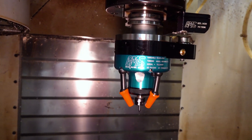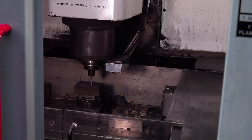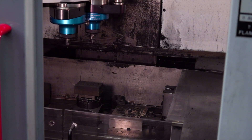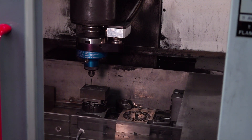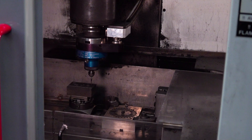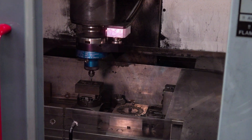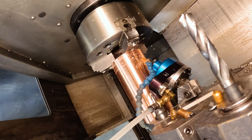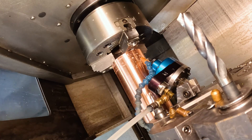You dial that thing into your zero degree — wherever you want that to be. Say you're drilling holes on an ID, four holes on a 90 degree pattern. You're going to set your zero, and index whatever your P-value is to the next rotation — that gets you within maybe plus or minus half a degree. Now you engage that coupling, and that gives you plus or minus seconds, as opposed to minutes or half degrees. It's the same function and operation on our dual spindle option — there's a pin that comes into a bushing on our air coupling, and that's what holds the spindle from moving and holds your location accuracy.